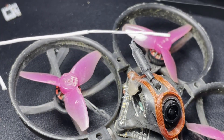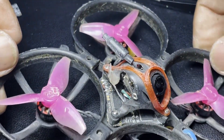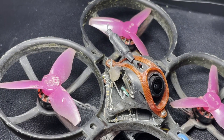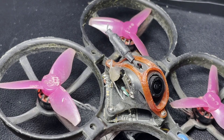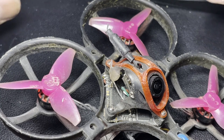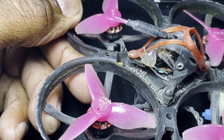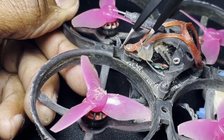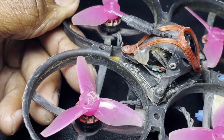I cut it and left it at the same length — 30.83 millimeters. But when I looked at the decibel reading while flying around, it wasn't satisfactory to where I wanted it. So I cut it a little bit more down to the 28.8 millimeter size and I got the best reception. The signal was actually better than the factory ceramic ExpressLRS antenna — just by having the wire sticking up like this, you get better penetration and can get signal behind buildings.